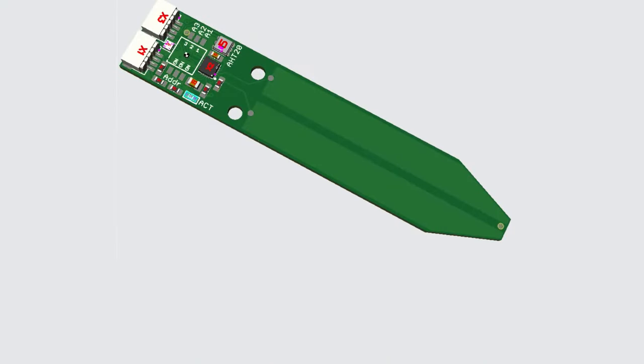By request, Carter really wanted me to update the soil sensor, because using the capacitive peripheral on the SAM-D09 wasn't linear and was a little annoying. So this is a version that uses capacitive sensing but doesn't use a peripheral — it literally just excites a one megaohm RC filter and just measures the delay to determine the capacitance.